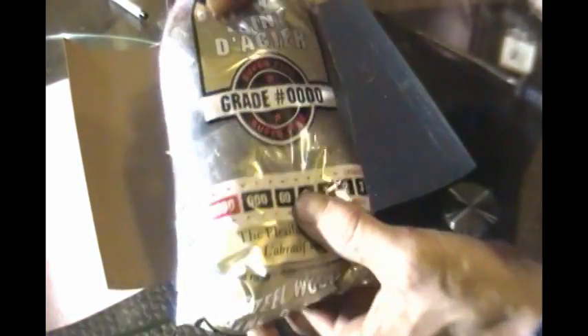These are the sandpapers I'll be using. The file is roughly 60 grit, so to eliminate those marks I'll use 100 grit sandpaper, then 220 grit, then 400 grit, and finally quadruple-zero steel wool — the finest kind you can get, very soft and fluffy. You don't need to watch me sanding. The next step after sanding will be varnish.